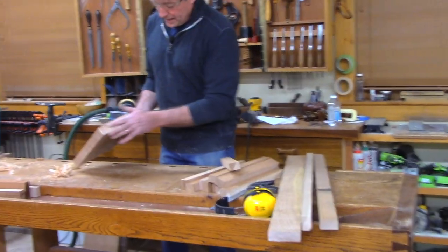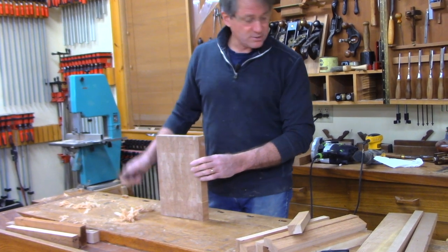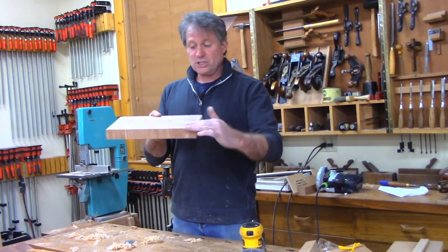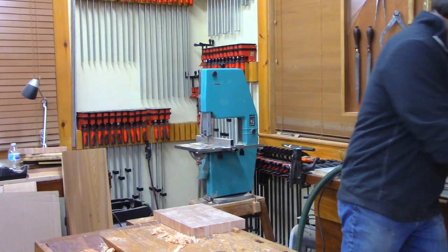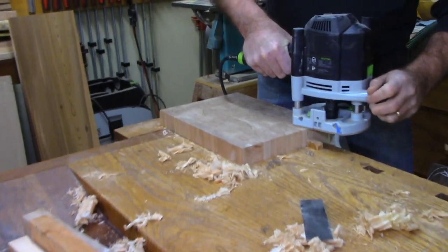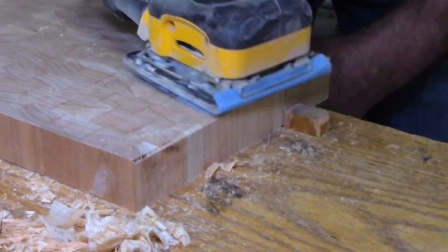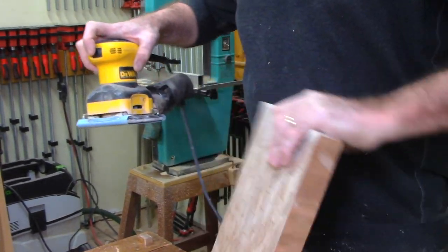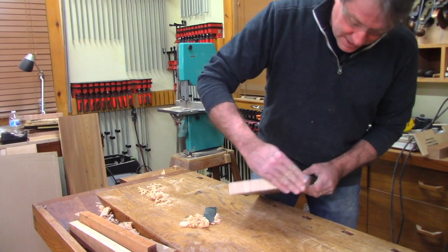I would go ahead and card scrape these ends a little bit here. And I would just use the palm sander on these edges. The last thing I like to do is round this edge a little bit — I have an eighth inch roundover right in there with the bearing. And of course, all around the board, I'd want to soften these corners a bit with some detailing. I'd soften all these corners, and I even want to break that under edge.